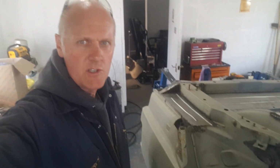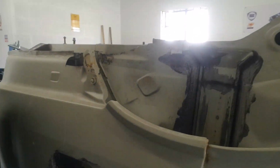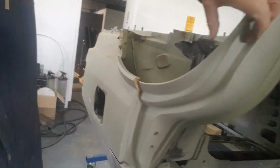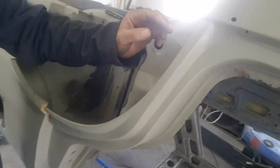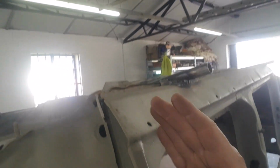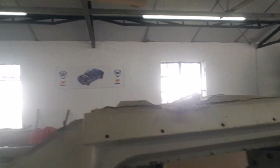So on the other side, you can just see what work we've got to do now is basically, this is all the standard arch. So we're going to have to cut all this away and follow the line all the way up here. Put our new filler piece in for the door close. We have to trim this end of the sill back as well. And you can just see in there, there's a little bit of corrosion going on. So that's no bad thing, try and get all that fixed up. But basically that needs slicing off, because it's slightly different length